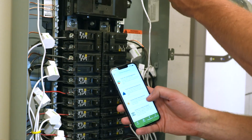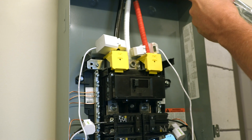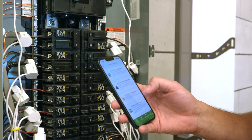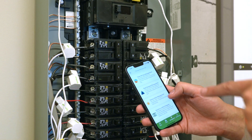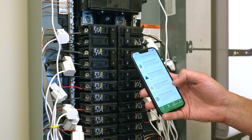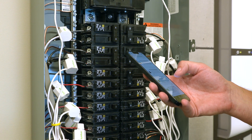We're detecting if you're producing more solar than you're using, and instead of sending that power back to the grid, we can turn on your EV charger. If a cloud comes, something goes down, we turn off the EV charger. We can set the rate of the EV charger to absorb exactly how much excess solar — so if you're only producing six amps, we'll set your charger at six amps.